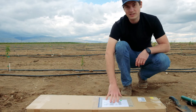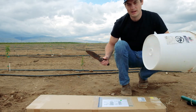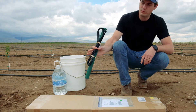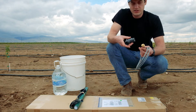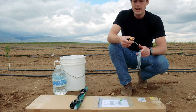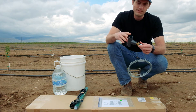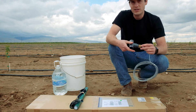Before you start your installation you're going to want to make sure you have your auger, a trowel, and a bucket for mixing the slurry. You'll also want a jug of water — probably a big jug. Make sure you have your probe. And if you're going off an ST100 or don't have a pressure sensor, you're going to want a T that connects to your irrigation line as well as a pressure switch. These are offered by Alltrack — you put that on your irrigation line and attach your switch so you know when your irrigation line is on.